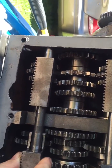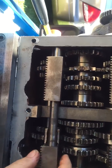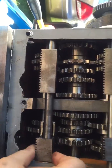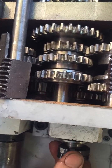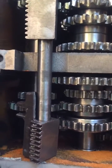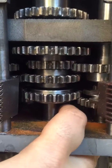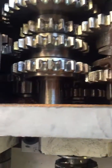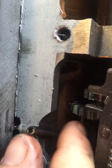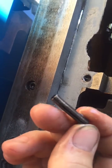Most of us that have these machines are curious by nature, no different. They got these little clutch things that pop in and out of place, gears going in and out. Anyway, if you look back in there you can see there's a hole in that gear — there's supposed to be a roll pin in it, but there's no roll pin in there. Looking down in the bottom and there's the roll pin. It's not broken, it's not sheared, it just fell out.